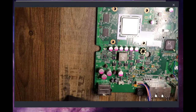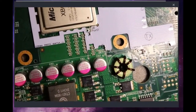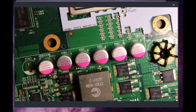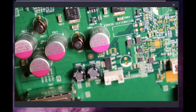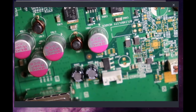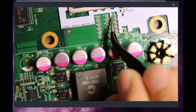What we need to do is solder on 2 anchor points here. I'm not sure how well you'll be able to see them, but what we're looking at is where the chip just got inserted. Where are my tweezers at? Oh, they're sitting right in my lap. So anyways, as you see, we're going to need to actually solder our 2 anchor points right onto this resistor right here.